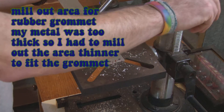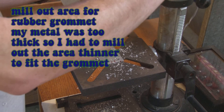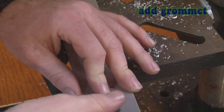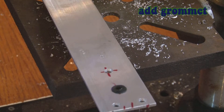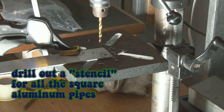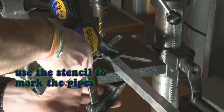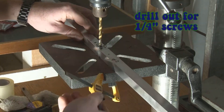On this next part, the first time I tried to put the grommet in, the metal was too thick for it, so I had to make a slightly bigger diameter indentation around the hole so the grommet would fit well. It actually sits very nicely, recessed almost level with the metal itself. I did that so I'm not accidentally fraying the insulation around the wires and exposing wire to the metal. I used the flat bar as my stencil to make sure I had the right distance of holes, drilled those out on all the square aluminum bars, making every single one uniform.